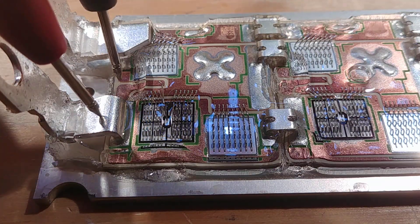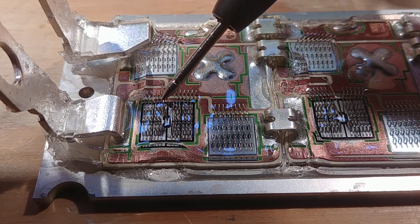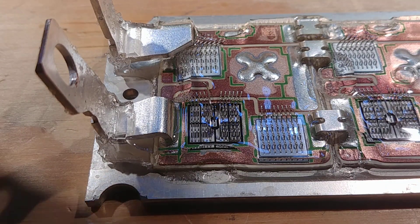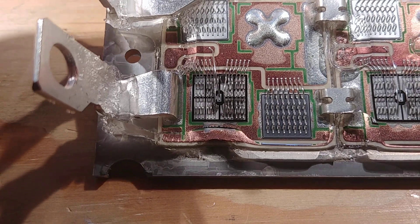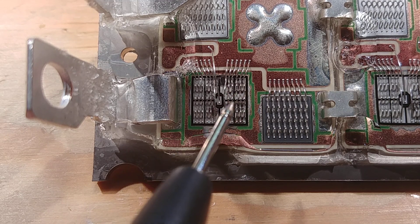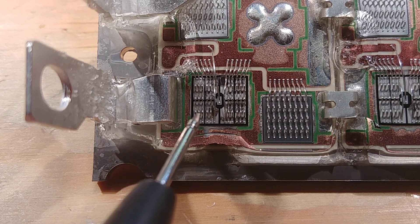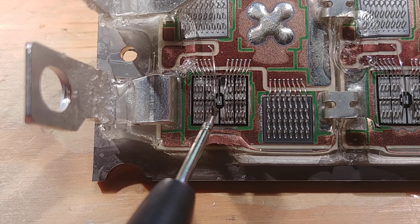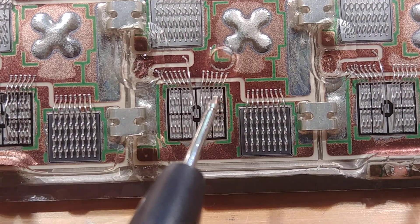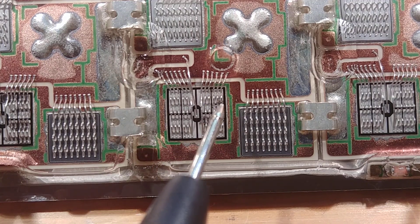Here's the gate on this one — you can see it's dead. You can see this is the gate because that pin comes in here and goes across the center of the IGBT die. If you look closely, it's got some discolored spots in here — that's where it blew up. So this whole section in here is dead. It actually looks like these two parts are okay, but that section is dead. See this big chunk here that's dead. This IGBT also has a dead chunk in here all through there — this whole side looks okay, but this one looks bad.